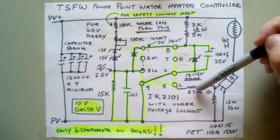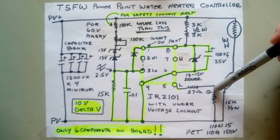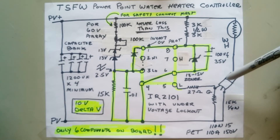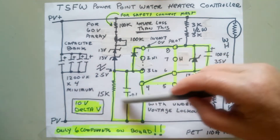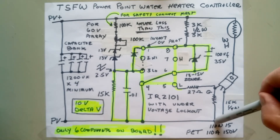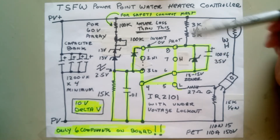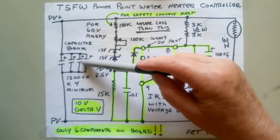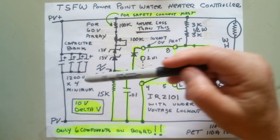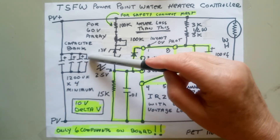The low output — you can put this resistor in heat shrink. You always want to have a resistor across the FET; you can put it right across those two pins. The ground of the controller should always go right to the FET, and your PV should also go right to the FET so you're not creating any ground loops. For the capacitor bank, you can get away with four — I use seven in my system — and more capacitors is better.